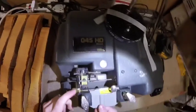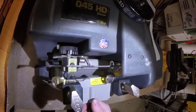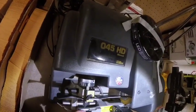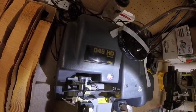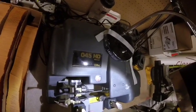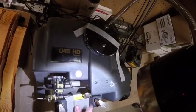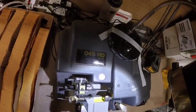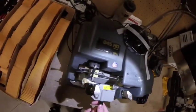The way this works is the adjuster on the left will follow the grooves exactly along where this key has already been made. You can see the grooves on my finger here — it will follow along as I'm cutting. The key on the right will be cut by the buzz saw as soon as I turn the machine on, and will get cut with the same exact grooves. So without further ado, let's get it started.